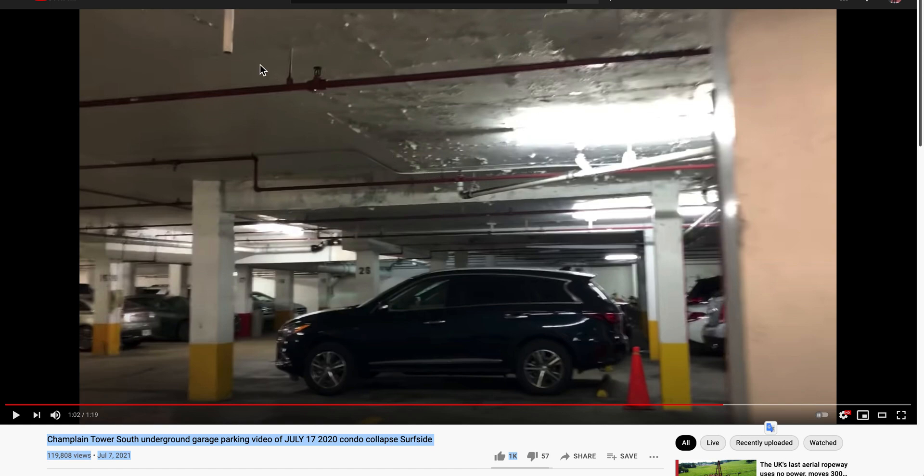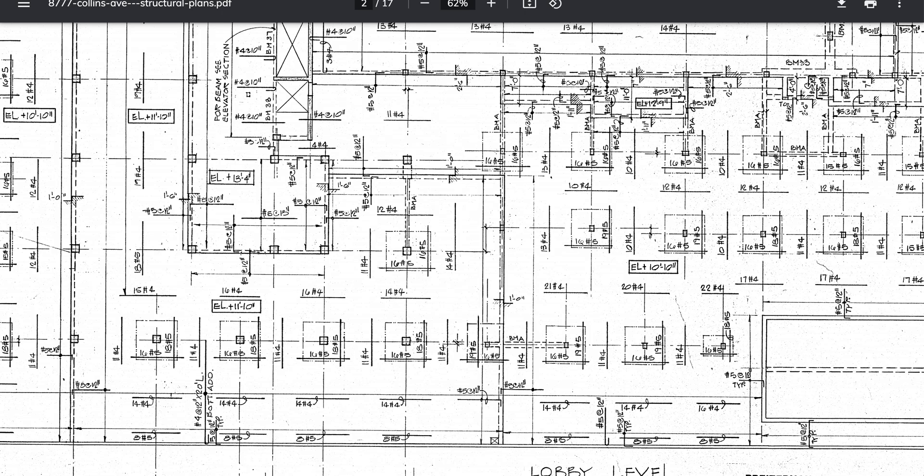I've been going over these beams — I want you to see this. That looks like a through-the-floor drain. There's a BMA supposedly there along here. But the overhang would be a cantilever the person's asking me to look at — it would be from here to here. I think what they're leaving out is part of their formula. This box, this void, gives us a plane also right here. So the cantilever reaction would not be where the person thinks it is. The load would transfer thereabouts here because of the planter boxes.